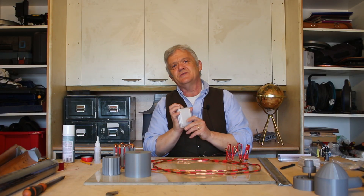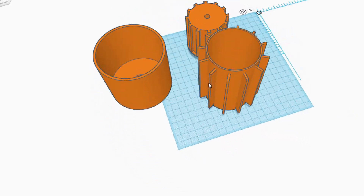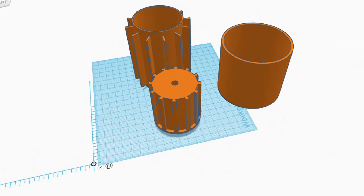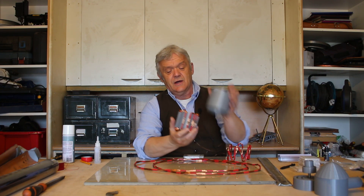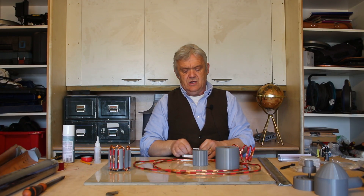What I've got here are 65mm by 1cm by 3mm N35 magnets. I've drawn this up in Tinkercad, and it's three parts — a rotor, a stator, and a cover that joins it up to the rest of the wind turbine. We've got a stator with wire already on from video 1929, a rotor where our magnets are going to go, and a cover. All three just slot together to make our generator.